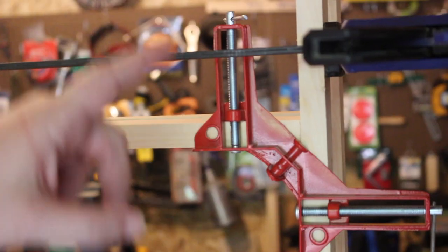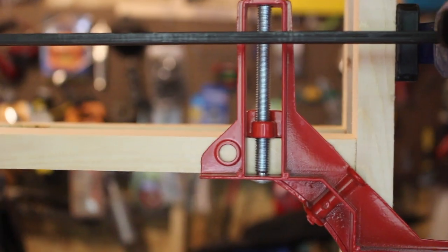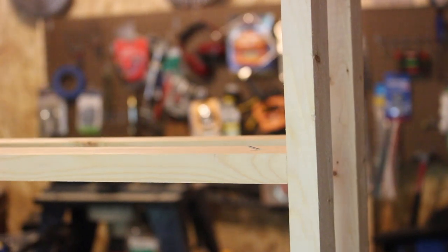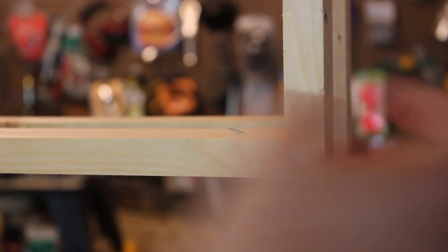The only difficulty that causes is that in order to use our nail gun we have to go from the side because it doesn't fit otherwise. We're going to be sideways but we'll use two brad nails — we already have put the glue. That's why you need a lot of clamps in your shop — especially a variety of sizes. We're going to finish putting in the same way a shelf, then do the last shelf, then put the wheels on, and last we're going to put the face piece on.